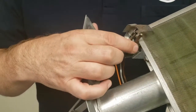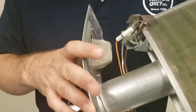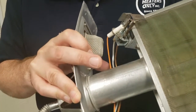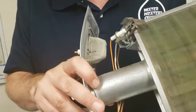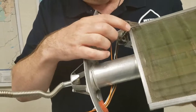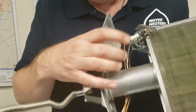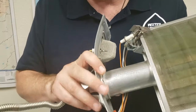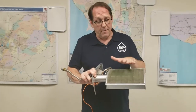This little three-prong right here is your Piezo sparker. This will spark and light the gas coming through the pilot tube, which is right here. And then this little genius guy right here is the thermocouple. That involves two different types of metals, which when heated produce a small electric current. While the pilot flame is going, this current running through here keeps the gas valve open. If there is no flame, no heat, and the flame goes out for some reason — mechanical failure — this will shut the gas off. So it's a very neat system, and pretty basic other than that.